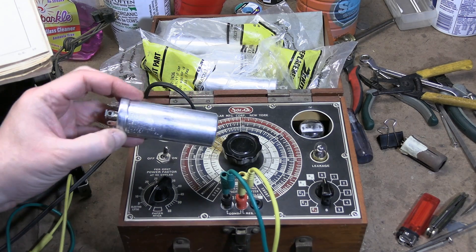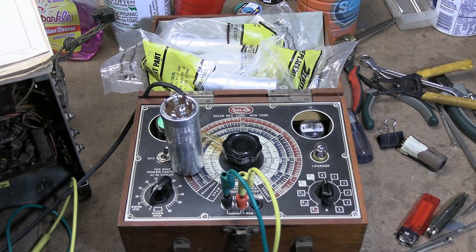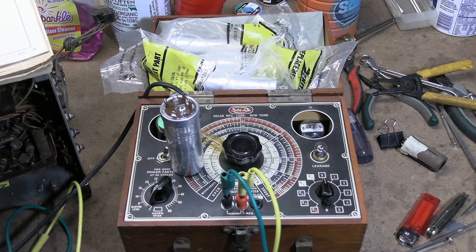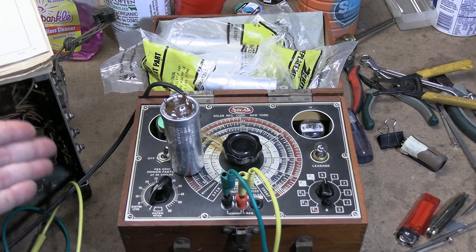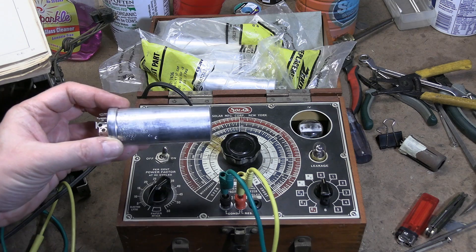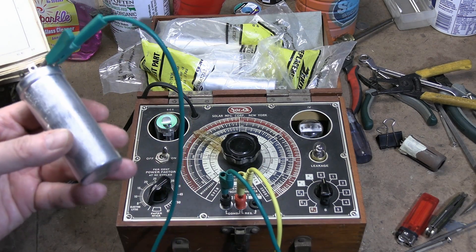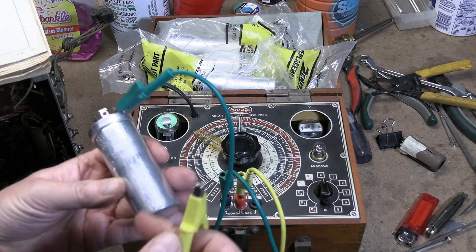I don't recommend it, but if you are a vintage electronics enthusiast and you've come across some of these vintage parts, I'm not saying you can't use them. If we can form it up and it tests okay, you could use it, but I would keep an eye on it. I wouldn't use it in something I'm restoring for somebody else who doesn't know about electronics and just wants their thing to work, because I can't guarantee they're not going to fail prematurely. They're already well past their shelf life. Unlike vacuum tubes — vacuum tubes have essentially an infinite shelf life. As long as no air gets inside, a hundred years from now they could still be fine. These, not so much.